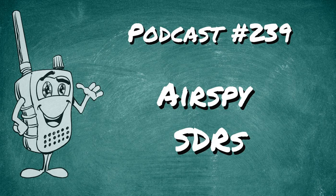We are looking at AirSpy devices. What if we want to go into HF? I've got two options. The first is a dedicated device called the HF Plus Discovery, which replaces the HF Plus dual port. It sets you back about $200. It covers from 0.5 kHz all the way up to 31 MHz, plus 60 MHz to 260 MHz — so it's HF plus VHF. Just like the R2 and the Mini, it has a 0.5 ppm high-precision low-noise TCXO, and no drivers required — simply plug and play.